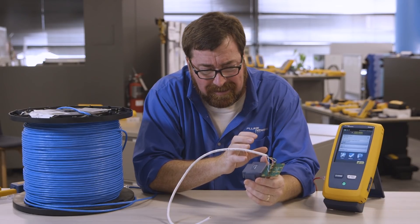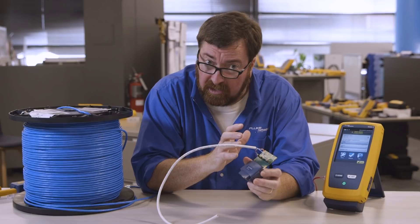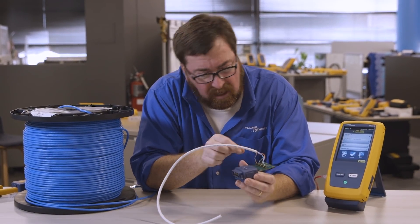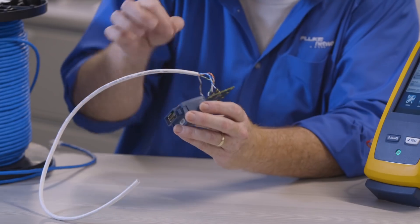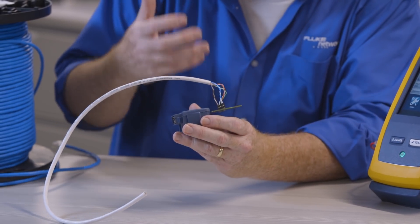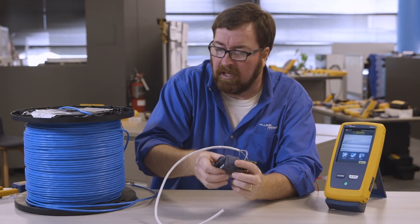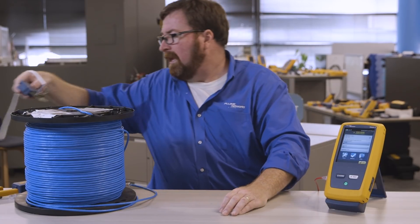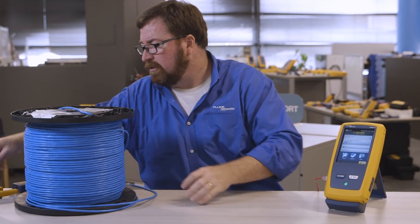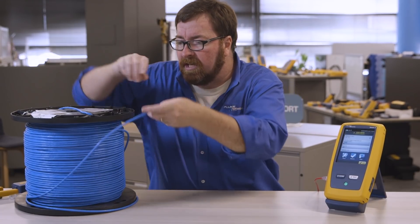The tricky part is this is a little bit time-consuming to finish. It helps out if you've got a good technician — perhaps an intern — who can spend some time making sure they don't untwist the pairs, maybe even put a heat shrink tube on so the pairs don't get separated. But again, that's something that's going to be time-consuming and it's not ideal for a volume project. If you're producing cable and you need to test 10 or 50 spools a day, that's going to take you some time.